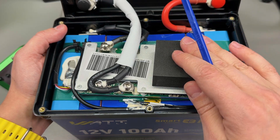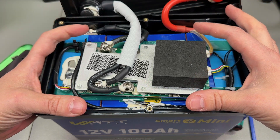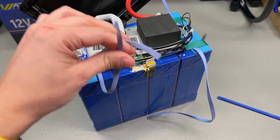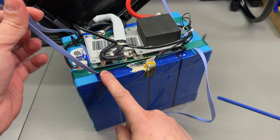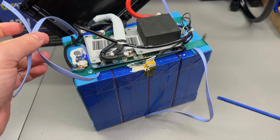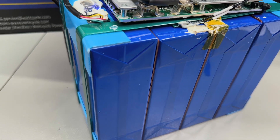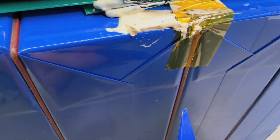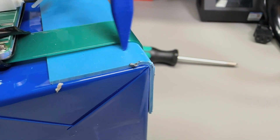On the positive side, they use a thick block of foam to prevent the BMS from rattling inside, as it stays pressed by the top cover. I was able to slide the entire pack out of the case fairly easily using the flat wires under the welded plastic straps as handles. Inside we see foam padding keeping the pack firmly in place, and a generally clean construction — four individual battery packs with insulation between cells and plastic insulators on the outside so the welded straps don't put pressure directly on the cells.